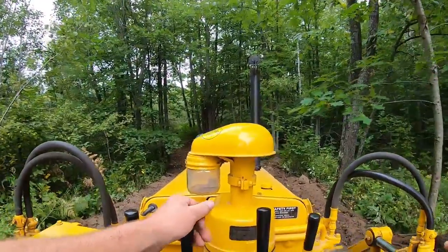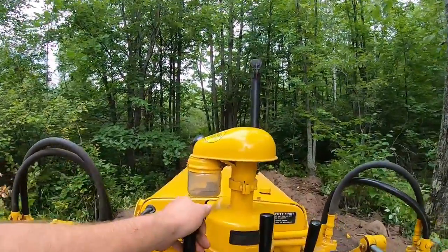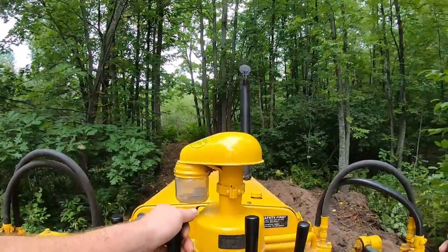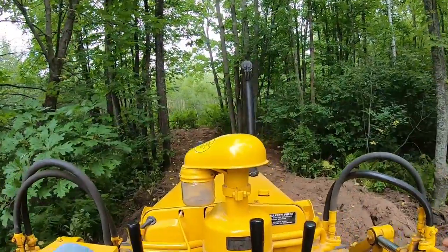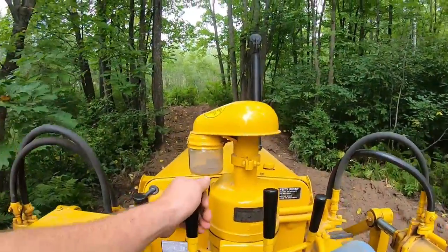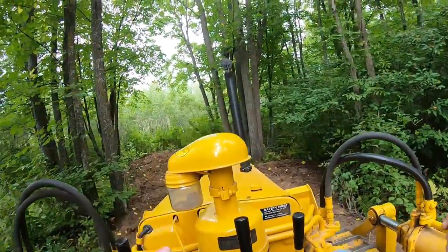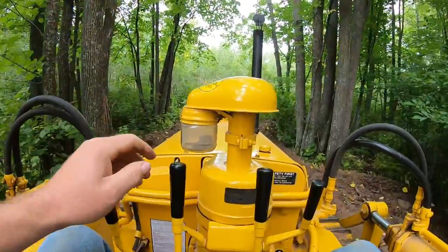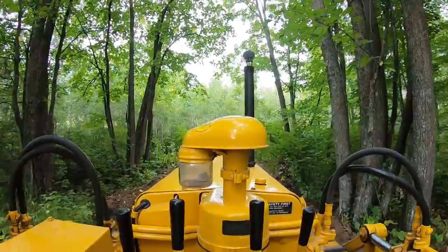It'll be good just to hang out and ride a little bit. Release the clutch. Drive her left a little. And clutch again, tap the brake. Blade so you don't dig on the flat. Left clutch, snap the brake, you're pointing in the right direction. Blade's back to level, we're just carrying the material.